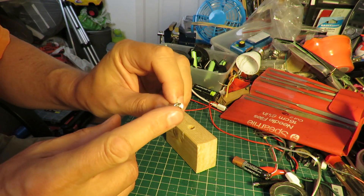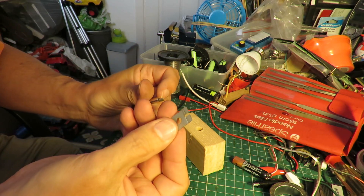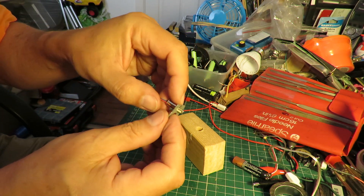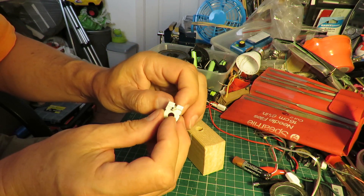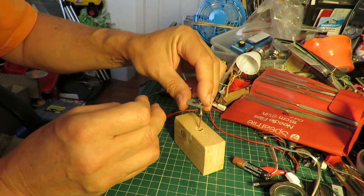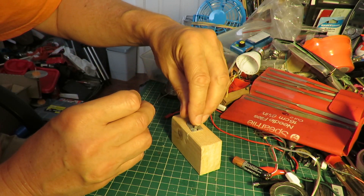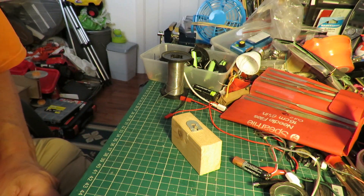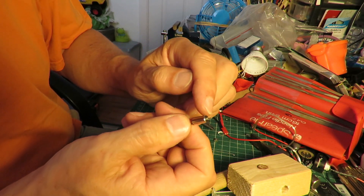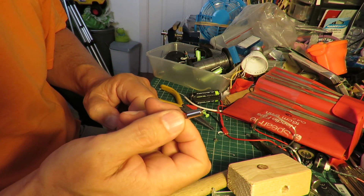This is my method for removing the little weight. I've got a block of wood with a hole in it and a piece of metal with a slot in it. That slot goes between the weight and the motor so it should be supporting the weight. I place that in there and then tap the centre of the shaft with something like a pin. Finally, fourth time lucky — I've managed to get one off without bending the shaft. So I'm down to a 25% success rate this time.